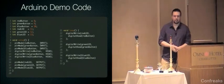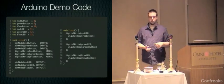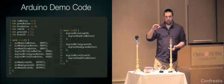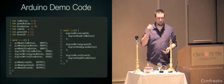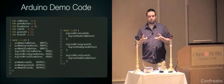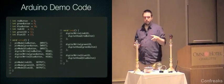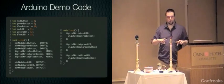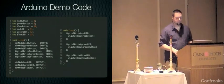There is also some complexity that I'm hiding here in terms of the way that the buttons are wired and the LED is wired, such that the buttons, when they're not pressed, are high. And in order to turn the LEDs on, you have to pull their pins to ground. So it's kind of like the inverse of what you would think. Normally, you would think apply power to turn on the LEDs. Because of the way this LED is set up, it's actually the reverse. The nice thing is the buttons are the reverse, too, so I can still just do this digital read, digital write. Anyway,